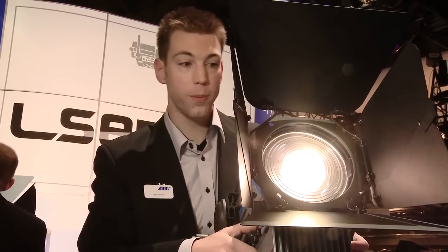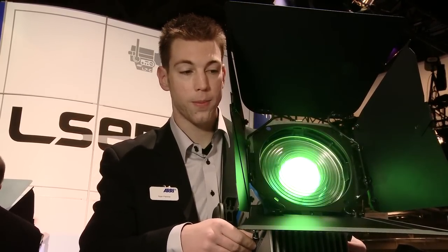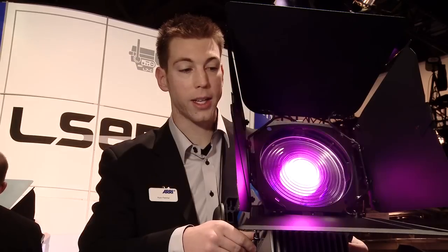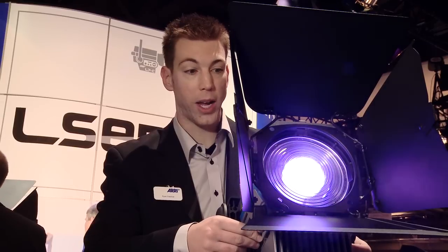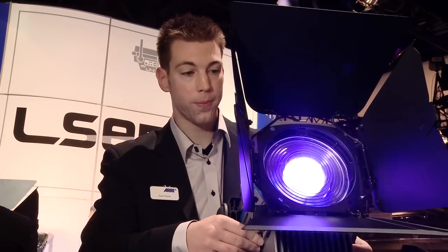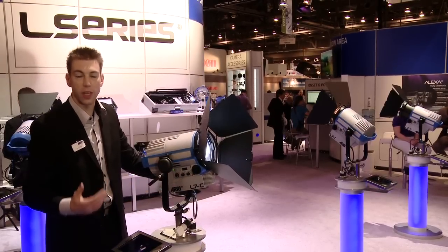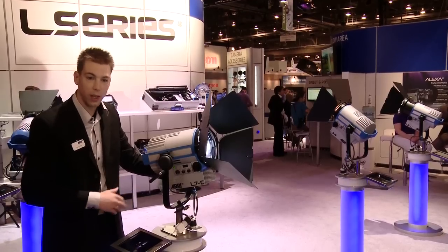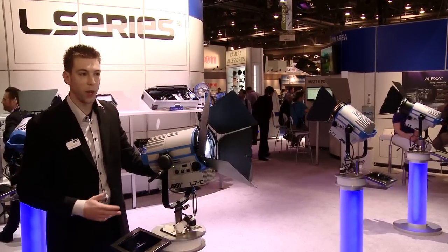You can also switch into color mode — hold down the function button — full color gamut. So you can find a color that you like and then adjust the saturation, dial back towards white or add in some pigment. In addition to the onboard control, the fixture also has full DMX control. DMX control is 16-bit, so the fades are smooth. You can crossfade from one color to the next, from white light to colored light — everything that you would do remotely.